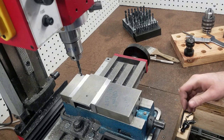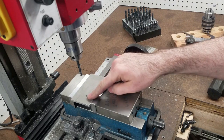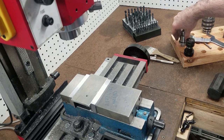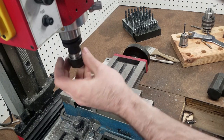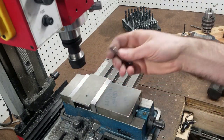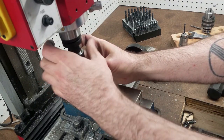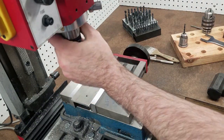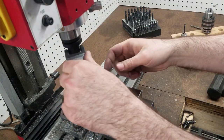All right, I guess it's time to try it out. So the situation will be, you've just drilled your tap hole, pop out the drill bit, and probably have it set up in advance, but you can set it up now. So with the appropriate size collet, it's our M6 tap. I just have this collet tight enough just to hold it up.